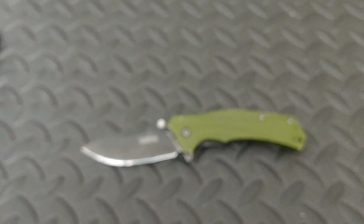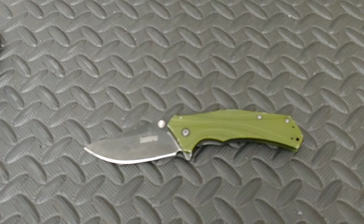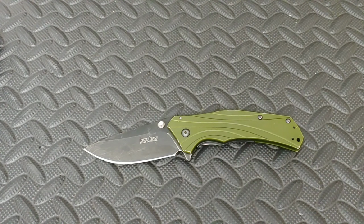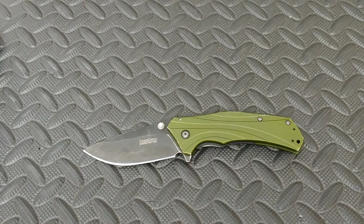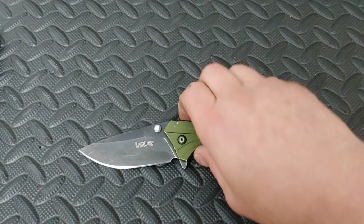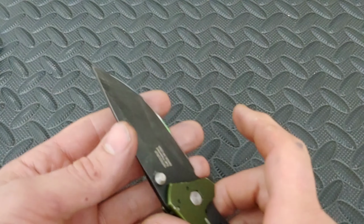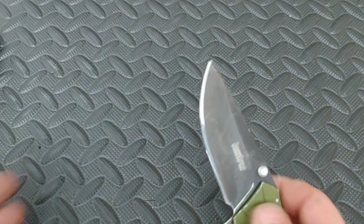Now, depending on how much time you spend on it, you can get it shinier, and also based on the pressure. And when you're finishing, you want to go from using pressure to using lighter and lighter and lighter pressure. But you can get an absolute mirror, and a nice mirror that has still some bite to it. And that's what I do like about it, is that it comes off the stone very sharp. And like I said, that depends on the steel too. Some steels don't like a mirror polish. Some steels just do better with a lower grit.